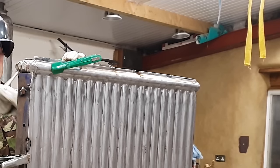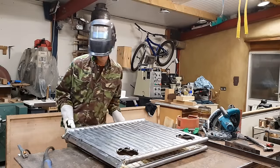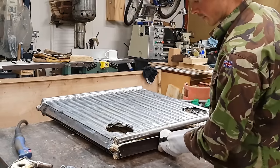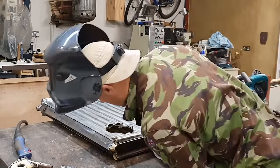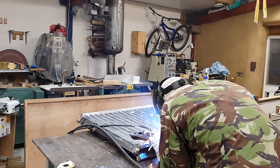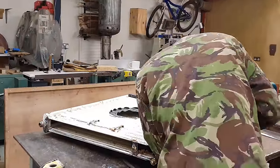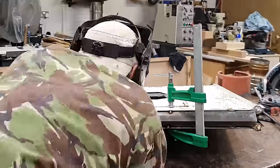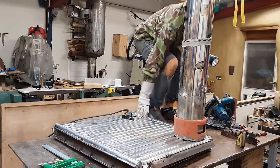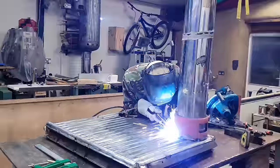Now, using angle iron as a spacer between the leaves of the radiator has some advantages and disadvantages. It's great in that it fills the gap that it needs to when you orient it like this. It has a big tolerance in the sort of distance it will cover. The downside, well, that's the corners, and they were always just going to be quite tricky with the shape of the radiator being what it is. Again, we're relying on the inexorable upwards movement of the smoke.